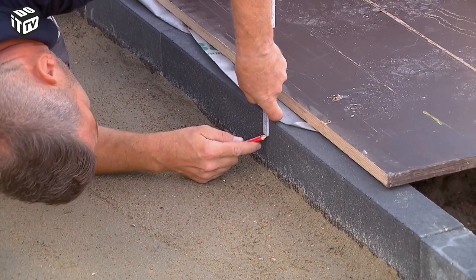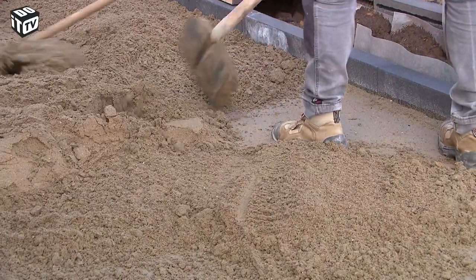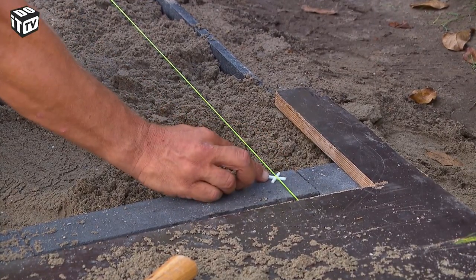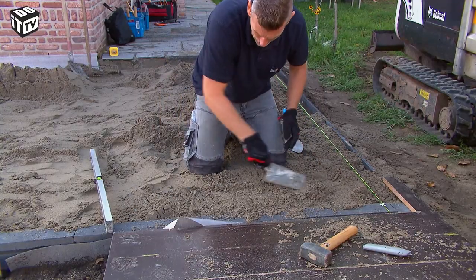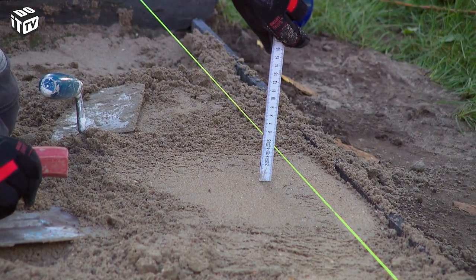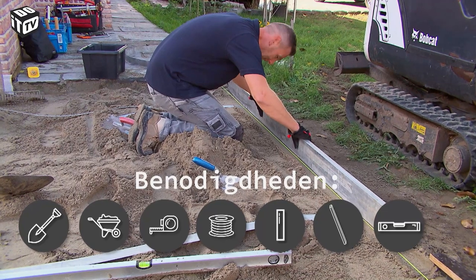On top of the foundation comes a street layer, up to 4 centimeters below terrace level. Pour a large amount of stabilisé and distribute it over the surface with a shovel or rake. Place a tension cord to maintain the correct height and drainage. On the side of the flower box, we carefully place a joint cross between the rope to also guarantee drainage in that specific direction. From the rope, you can measure whether your street layer is high enough.